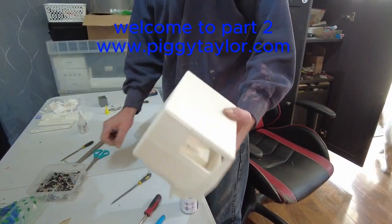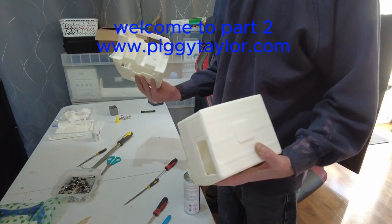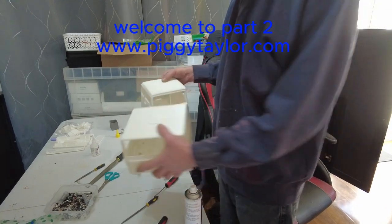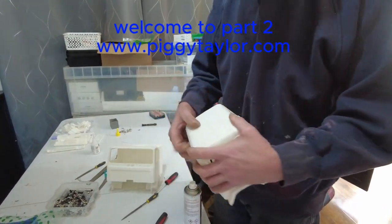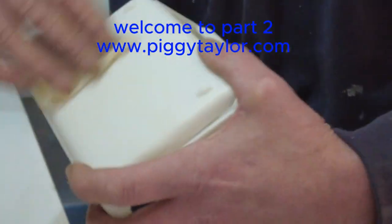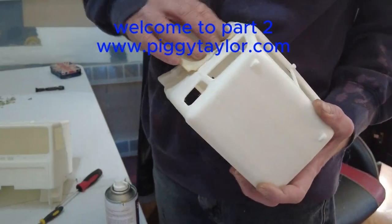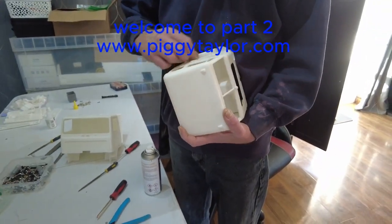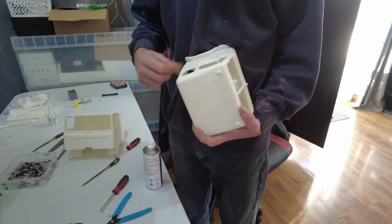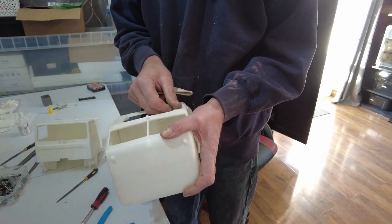It's pretty strong, definitely strong enough to sand and do everything you need to do to it. What I'll tend to do, when I've just done it here, is go over it with 240 grit sandpaper beforehand. Basically what you're doing with 240 is taking some of the shine off. I'm just nibbing it, really. Then I'll do all the panels and just sit down for half an hour, taking most of it off, and you feel it's quite smooth. They are very good for 3D prints.